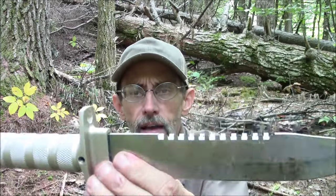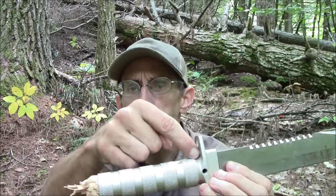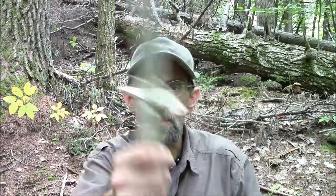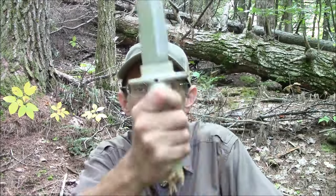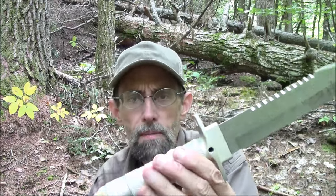Let's say you had a knife like that, and it's nice and thick, and then you got a handle, like a squarish handle, with that slab going all the way through. Well, that has weight to carry on the trail, but then it makes a whole knife different, because with a light aluminum handle, it's hollow, it's blade heavy, good for chopping, feels good, like a little machete. Okay, so you have this big slab of metal for the full tang, and then it's handle heavy. And it just doesn't feel right, doesn't feel the same. So there are trade-offs.